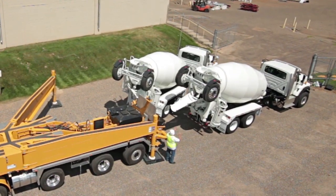What this really means from a practical side is you can set up a 61-meter in an area that's 27 feet wide, get a full 200 degrees working range at full boom extension, with plenty of room to get two trucks back to the hopper.